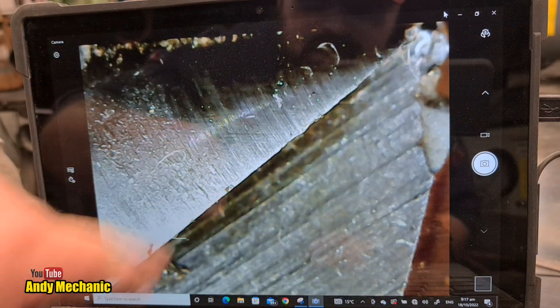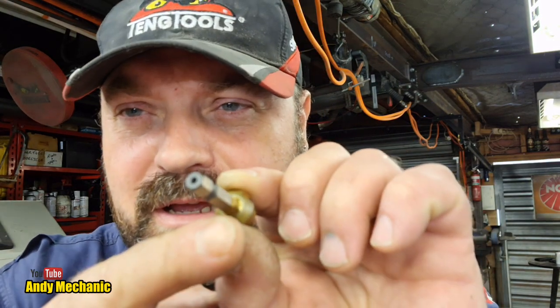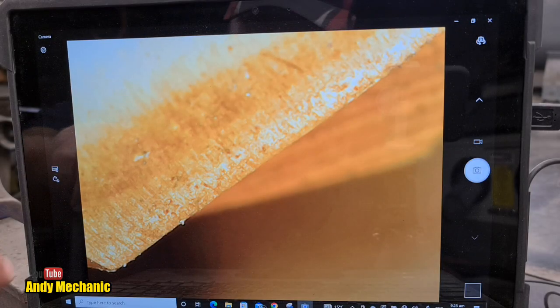I've found what I think is pretty much a brand new one. The only difference with this is it's on a hexagon shank — I found that they don't slip in the chuck. On the milling machine, if it spun in the chuck sometimes the bit would recede into the chuck and it would throw your depth out completely. So I went for this hexagon shank style on the more recent ones, no more problems — the chuck grips this much better than the round bits and I think they're a bit cheaper as well. This one was likely only used for deburring, so very light work.